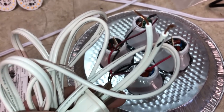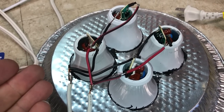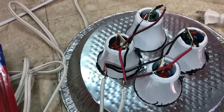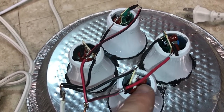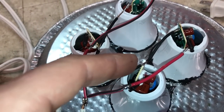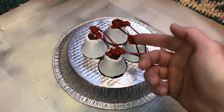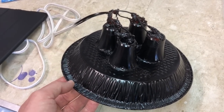The electrical cord here is salvaged from a discarded item. At this point the light is nearly ready to use, but I'd recommend making it a little safer. I'm using high-temperature RTV silicone to cover all exposed metal and wires on the back side — don't use hot glue here either as it will get warm. Once all exposed metal is covered in silicone, we give the whole unit a coating of spray paint. It doesn't look all that pretty, but there are ways to dress it up.